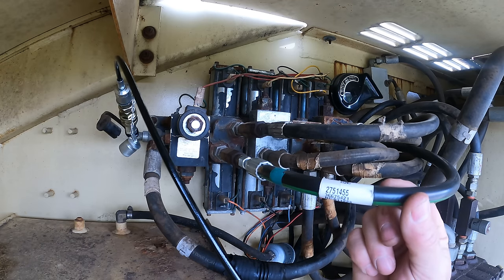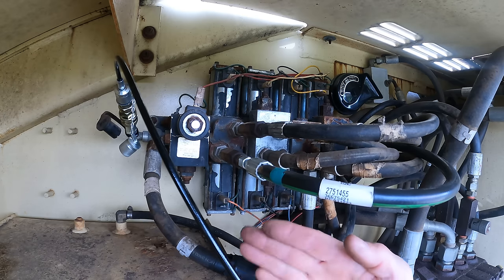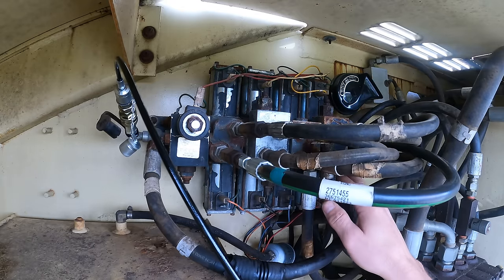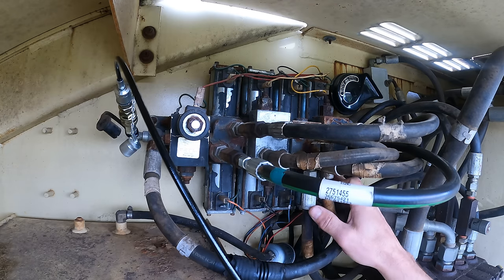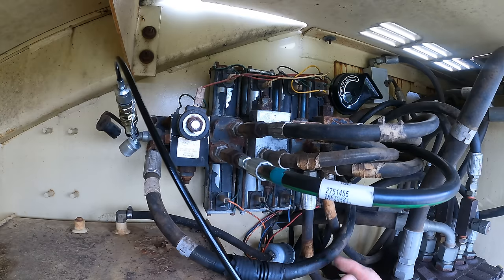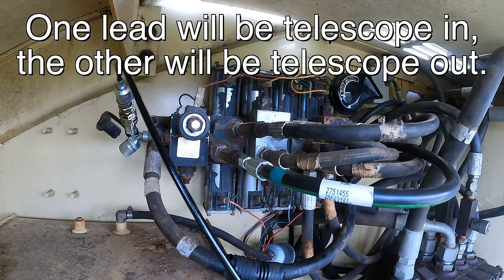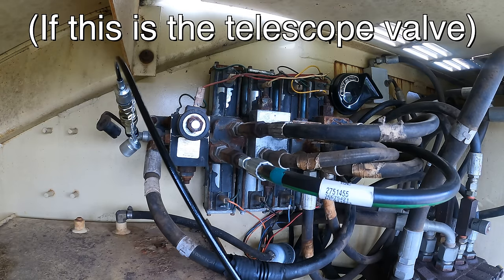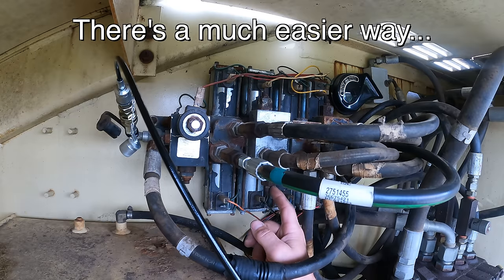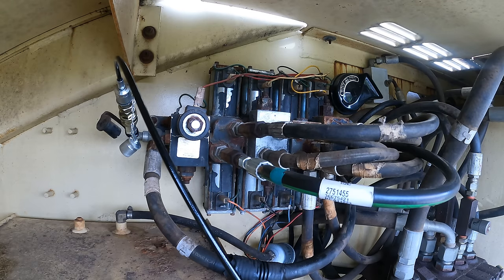This is a line I just replaced that goes out to the basket. I think one function is to rotate the basket and the other is to tilt it. They have telescope on the left in their picture and steering on the right, so I would bet that is steering and this is telescope. There are a number of ways I could do this — I could try to trace the lines, but that looks like a big pain. When I telescope, it will send power to one of these leads, so I can hook a multimeter up and check for 12 volts when I hit the telescope function to confirm which control this is.